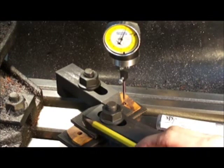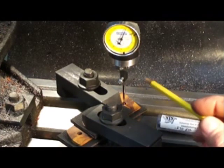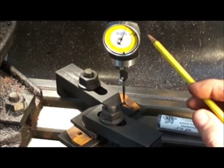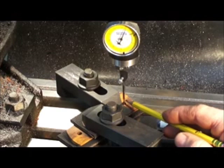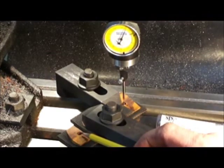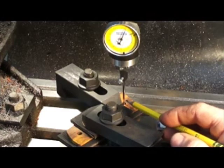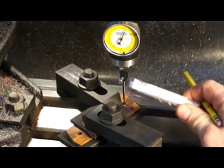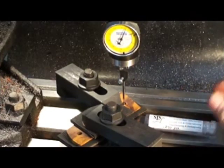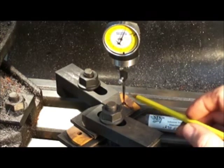Okay, at this point, we've already finished profiling the grip. We have the exact size that we want. Now we're using a coax indicator on the milling machine to find the true center of our grip hole. Once we find the exact center of this hole and that hole to within half of 1/1000ths, we'll pull our coax indicator out, put our special cutter in that I have sized exactly 1/1000ths over the diameter of the grip screw bushing and the screw head, so we've got a true precise fit.